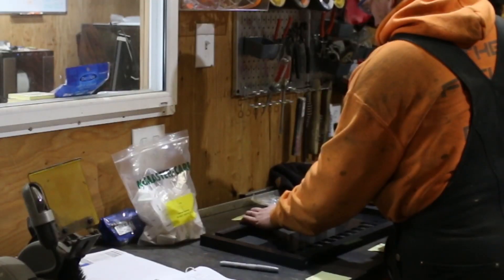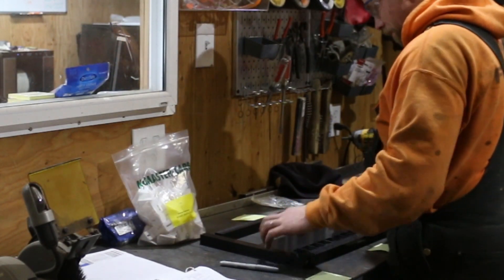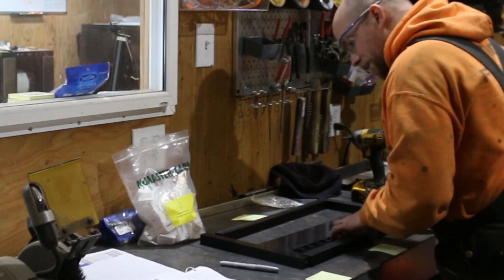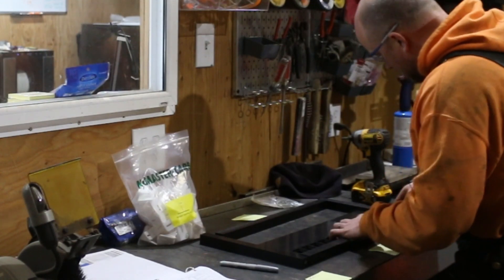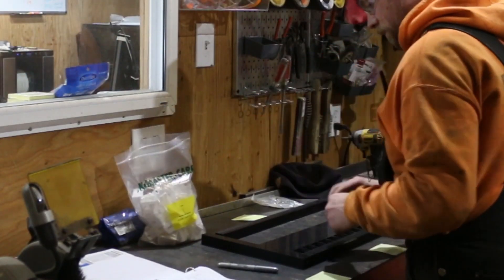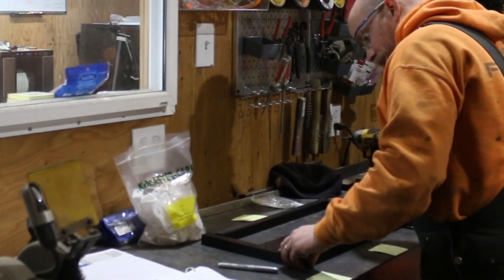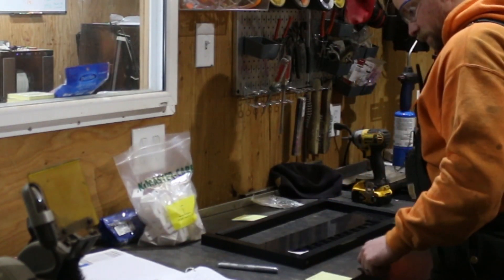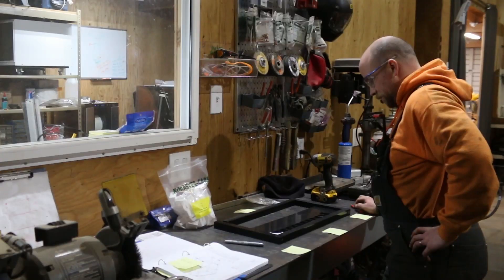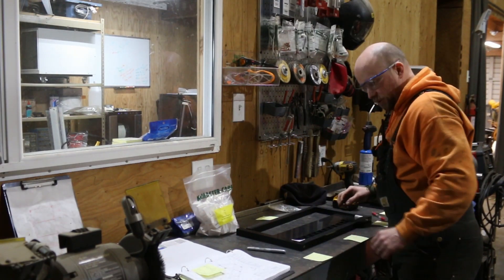This one actually has a really big screw-up from a machining standpoint. Somehow the slot that this panel sits in is totally off on this one over here, but it's perfect on this one over here. Then we're going to do a fit check — this should fit right in there, and it surely does. But that's going to be really hard to get in there and tighten those screws down. I didn't think about that. Okay, let's get it fixed.